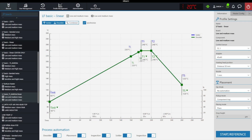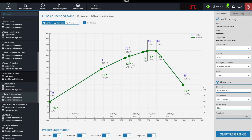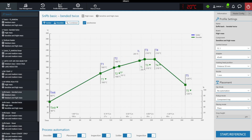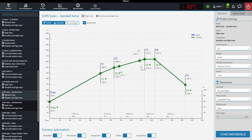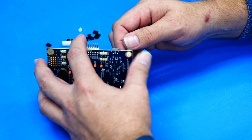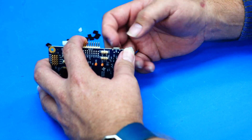The following is the correct method for removing lead-free ball WCSP devices from the board. Select the appropriate IC profile according to the device that is being desoldered. The device's datasheet includes the needed specs. Protect the temperature-sensitive components, specifically plastic, and remove any batteries from the board.